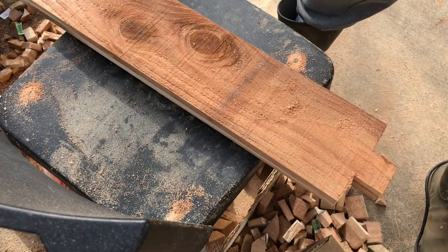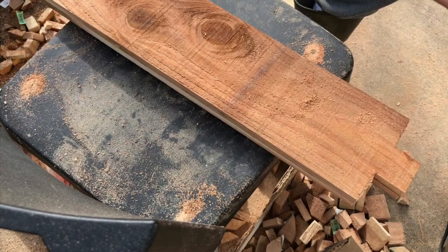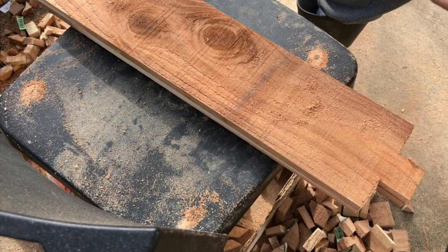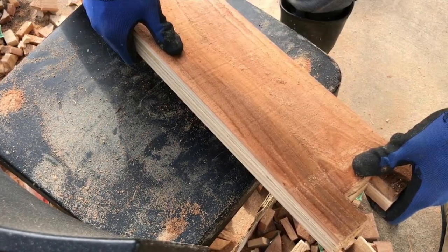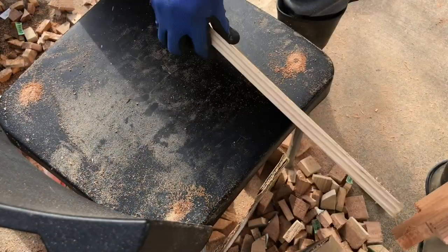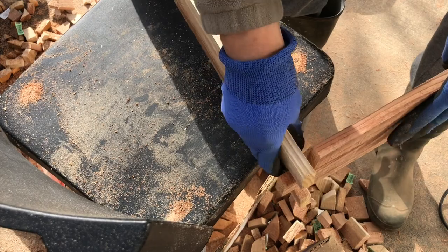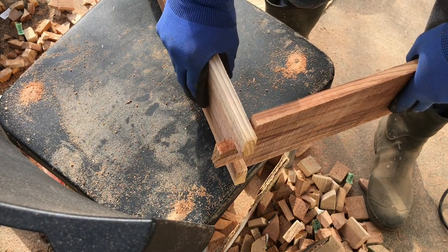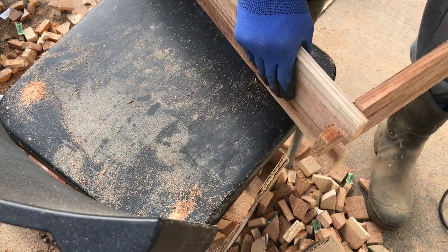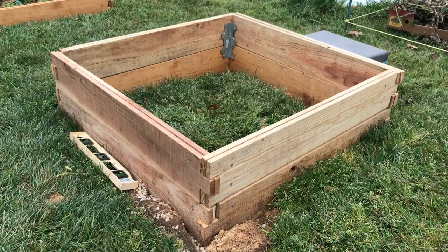This type of joint is similar to overlapping fingers. Once everything is assembled, one end will have what's called the pins and the other the tails of the joint. On one end of the cedar board, I cut two notches leaving an intact outward tab. Then on the other end of the same cedar board, I cut a square notch at the center width of the board. The moment of truth — you can see me putting together the outward tab inserted into the center notch of the second board. This initial dry fit also gave me the idea to double the boards on all sides of the garden bed. So after a few dozen boards and several hundred cuts, I am now ready to assemble the rectangular and square garden beds to reclaim the neglected part of our garden.